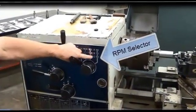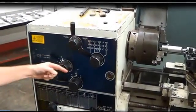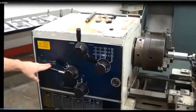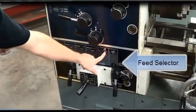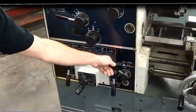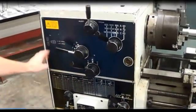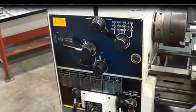The A, B, and C located here on this one dictates which RPM you're in, along with these lines in the position of the actual handle. You also have a feed selector. The feed is determined by this gear, and these gears in combination along with this one here. You can see how they have charts to match up the letters and numbers of the gears.